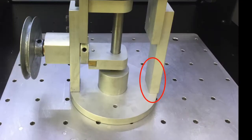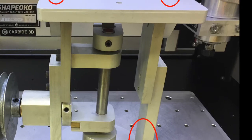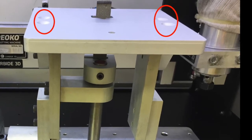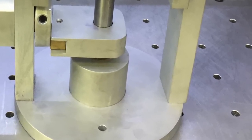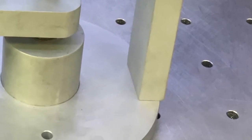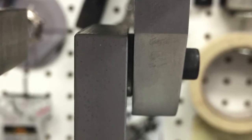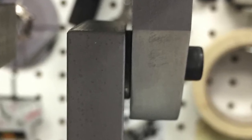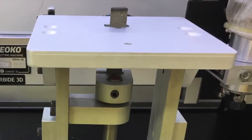All that's left is six more holes: two in the lower strut on the opposite side, and the four holes in the top plate. How you go about doing it is not critical — you can lay them out, drill and tap them, or transfer them. Just make sure the strut is not hanging off. I also recommend that you put a standard flat washer between the upper strut bracket and the swivel bracket to allow the upper plate to rotate freely and to keep everything from getting marred up.